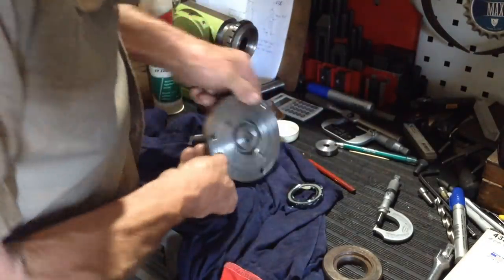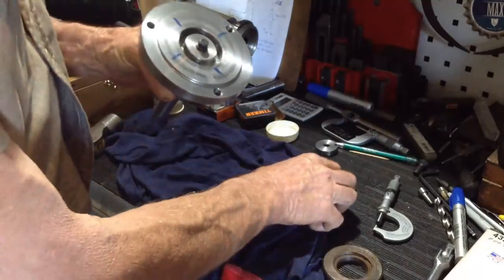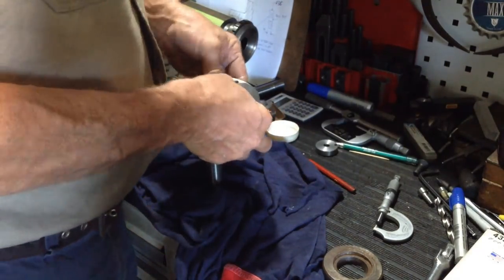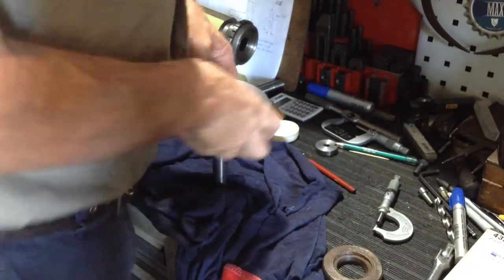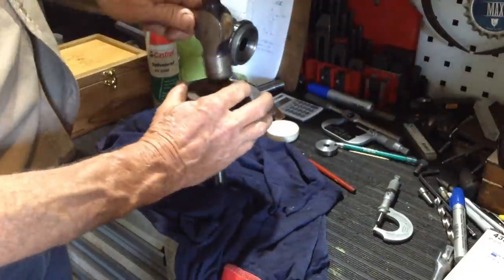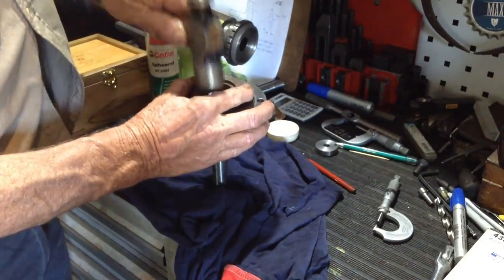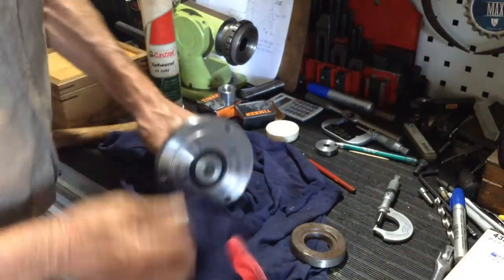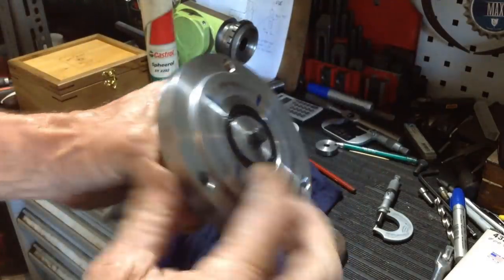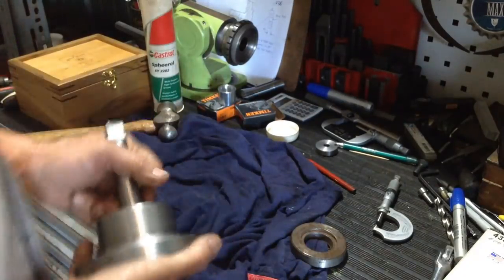So we'll move to the front seal. Now, the bearing retainer doubles up as a seal runner. So the inside of the seal will run on that bearing retainer. Right. Same deal. And we'll have to do the same with this one too. So I'll go and find something we could just push these seals in a bit further, and I'll bring you back.